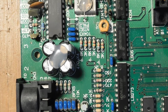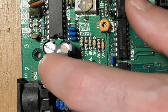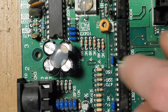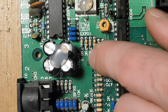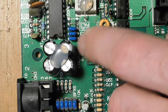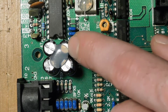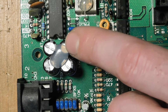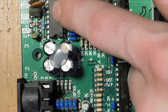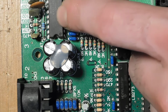You can usually find that information on the board, and people have documented what all of these motherboard revisions look like. So what we're going to do is remove these 3 capacitors right here. And you can see over here on the board there are 3 6.8 kilo ohm resistors that are labeled. We're also going to remove all of those. And then finally, this capacitor here needs a little bit of stuff done to it. We're going to just lift a leg on it and then wire that positive leg over to a specific point on the Sony CXA chip.